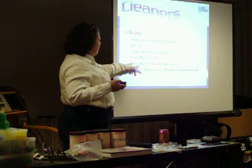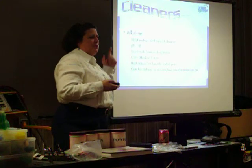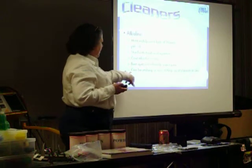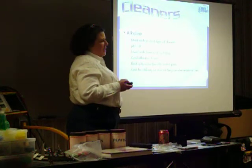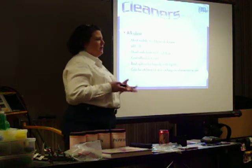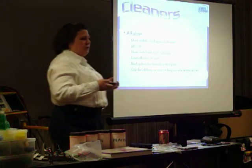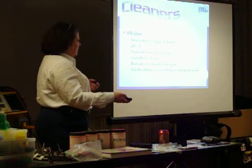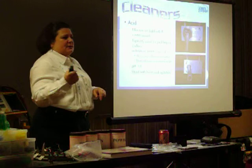If you've got a super heavily soiled part, an alkaline cleaner is going to be your best bet to get that soil off — it really does a very good job. They can etch or non-etch on aluminum. Alkaline is just the builder, the main component in that cleaner. We can formulate it depending on what you want — etching or non-etching depending on what you're going to do in the next step.